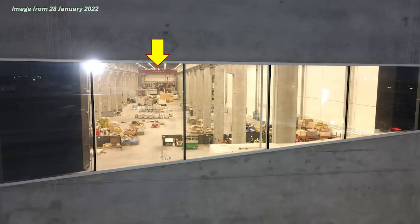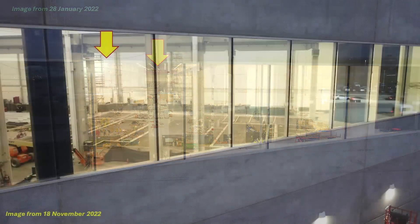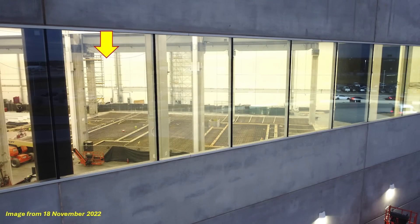Let's take a look at some images to give you an idea of how this has changed over time. This is from January 28th, 2022 — a great view inside showing this bay. At the far end, at that time, the first two of the 6,000-ton gigapresses were installed, and additional ones would be installed later. In this image, we can see the foundations being poured in November 2022 for the two 9,000-ton gigapresses that, about a year later, were installed. Those are now operational and they're part of making the rear casting for the Cybertruck.